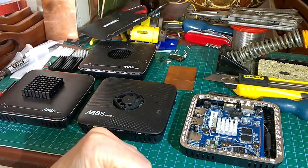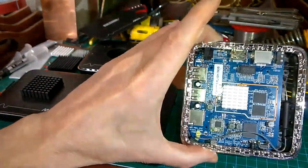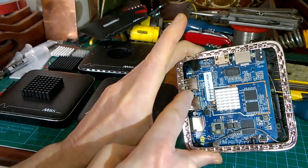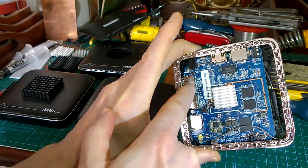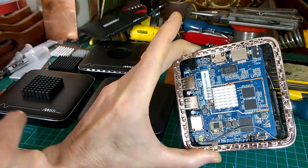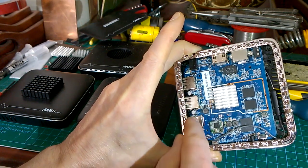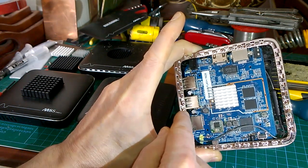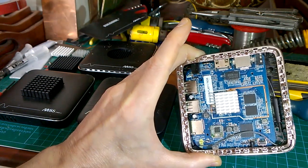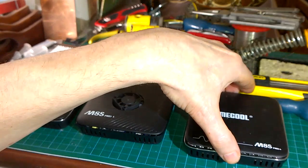The fan pins are wired to the UART sockets. On the Pro Plus, the UART sockets are four in a line — one is square, and the one opposite the square one is negative, the opposite end is positive. On the Pro L, they're between the micro SD slot and the USB, running in a line — the one nearest the edge is negative (square) and the one at the right is positive (round), with two data pins in the middle that you won't be attaching to.